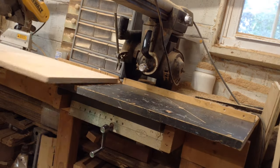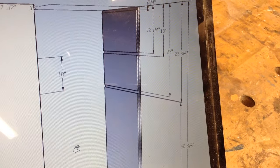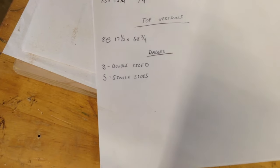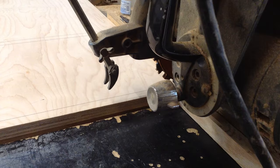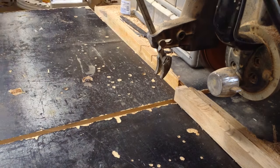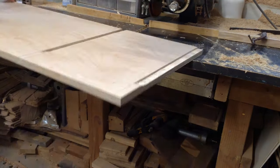As you can see it's the exact same process — I have my cut list and I'm cutting something like eight sides. They're all going to have the same rabbets and dados, the same tongue and groove on the front, the same rabbet on the back for the backer. Two of these are double-sided because they're in the middle, so I'm doing the exact same thing on the radial arm saw. I have my stop in place and I could cut all of my grooves with one setup.